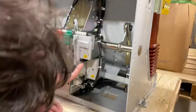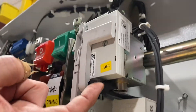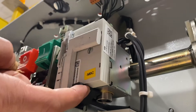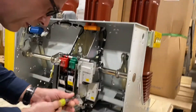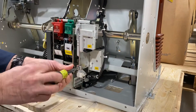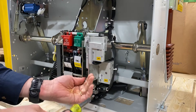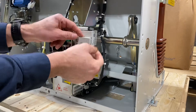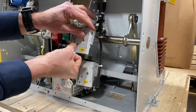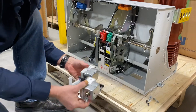If you look a little closer, that plunger pushes against the breaker at this location right here. To install this, you remove one screw here. ABB makes this nicely modular — you can pull this out and hold the whole assembly in your hand.